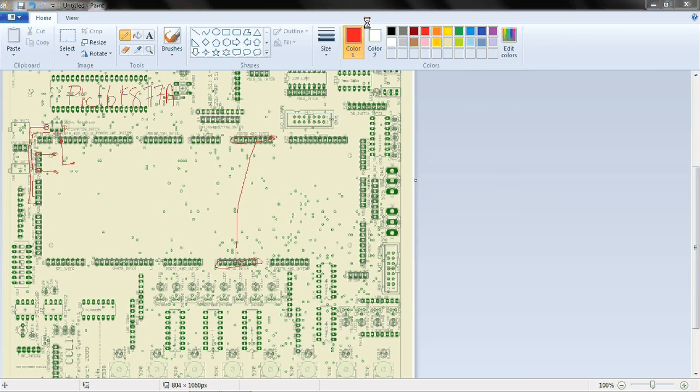So in this lab, lab 12, or the second one after the first 10, I'm going to take the previous lab, lab 11, and add a DC motor onto it, but I'm going to have the direction and speed controlled by the distance sensor. So the first things to know are that port C, pin 2, well, pin 3, if you're counting from 0 like I am, is the PWM.